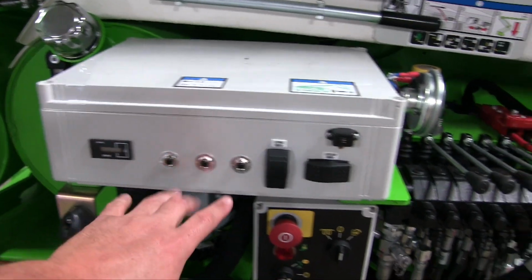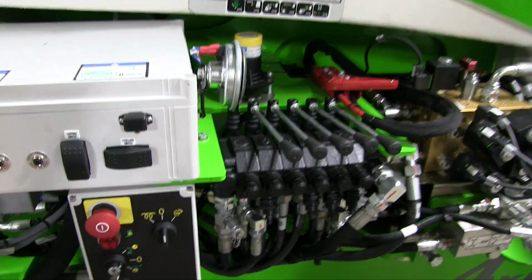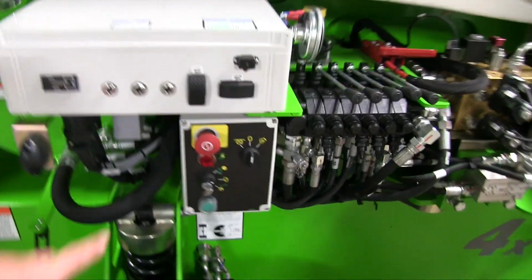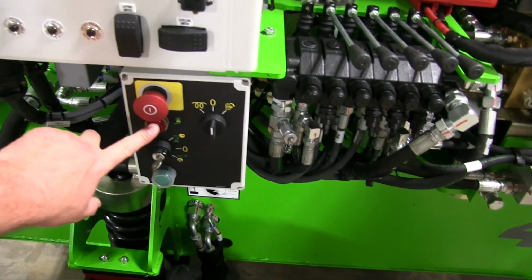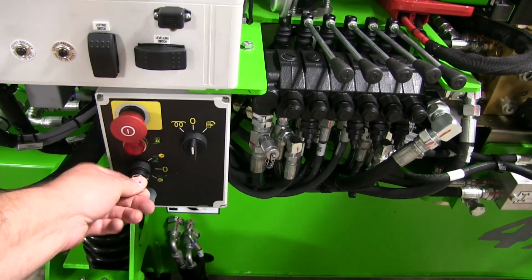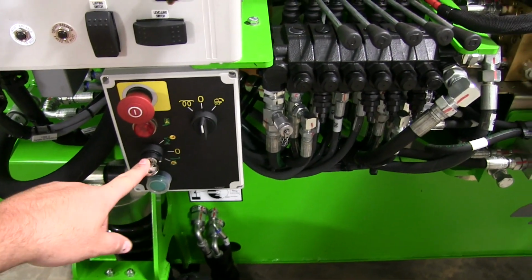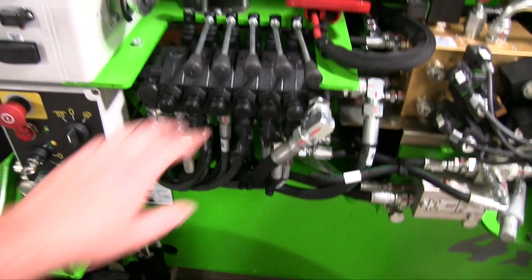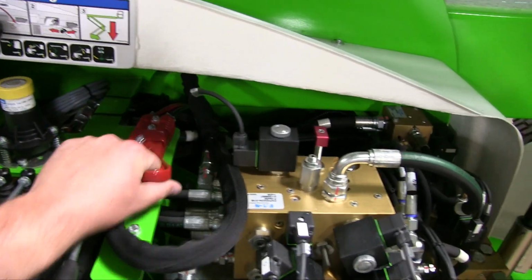There's our fuel tank. We have the engine hour meter, 3 circuit breakers, the luffing switch, which is for raising the boom for transportation, the leveling switch, which is obviously for re-leveling the bucket, emergency stop, preheat the engine, crank the engine, basket overload indicator, the key switch, that selects, right now it's in the off position, turning it up, turns it to the basket, and turning it down turns it to ground control. The ground level enable switch, all of the boom functions except boom rotation, battery disconnect,